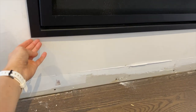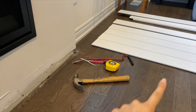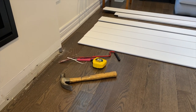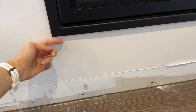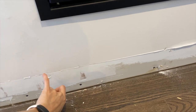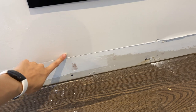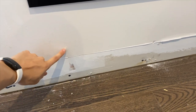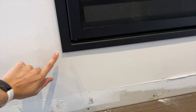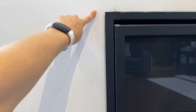The next thing I'm going to do — I don't want to make half cuts, I don't want to have to cut these boards in hot dog style. So what I'm going to do is cut the first piece of shiplap to place it here and work down, and then there's going to be a piece of baseboard. So if there's any gap down here that's less than six inches, I can just put the board here. I just quickly measured and I think I should be able to do full pieces here as well, so I'm hopeful for that.